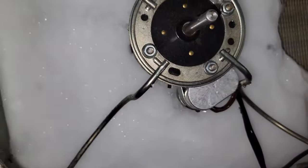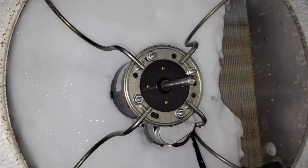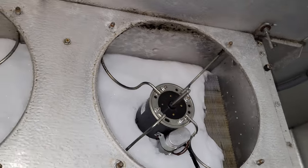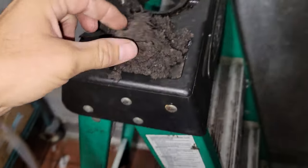We've got to slowly work on getting these things defrosted so we can get the motors out and properly get in there. I have someone downstairs doing that while I get upstairs to start changing the bad insulation — I actually have a piece in my truck. Looking at what we've pulled off the back of this coil: the coil is just impacted with nastiness. That can have a lot to do with why it's iced up.